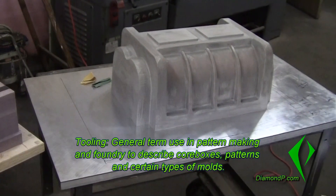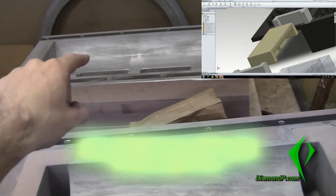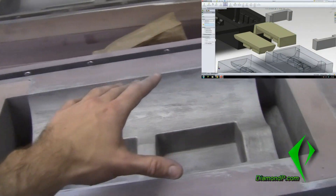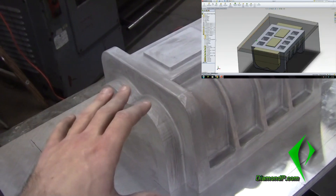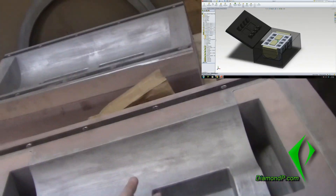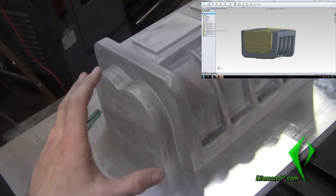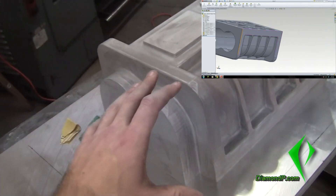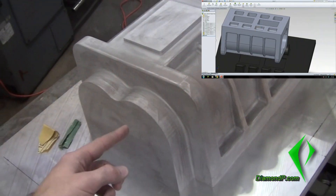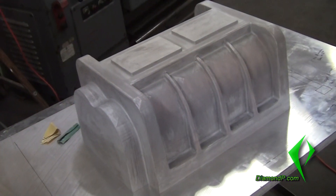This is the tooling that I've been making of the 671 supercharger. This is the pattern and these are the core boxes. How this works is this box will be filled with sand and that box will be filled with sand, and then the two pieces of sand will be glued together. Then when we make the mold from the pattern, the sand made from the core boxes will be set inside of the mold, and then the mold will be closed and we'll pour the metal. Once this part has been cast and we knock it out of the mold, the sand made in the core boxes will still be stuck inside of the casting. We'll take the casting and put it on a machine and the machine will vibrate and break the sand up — we just knock the core out of the part. This is called the knockout, and we'll be left with a casting that has been hollowed out. It saves a lot of machine time and extra material that we don't have to cut away, and reduces the overall cost of the casting.